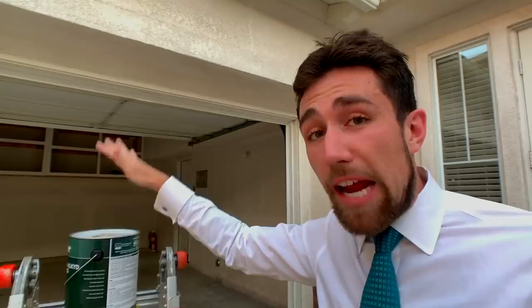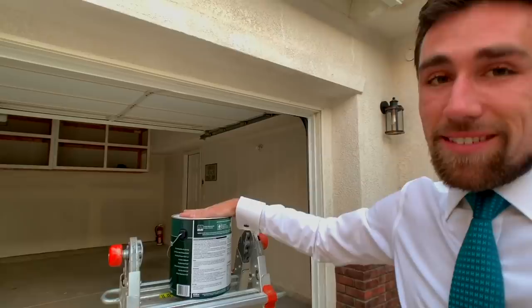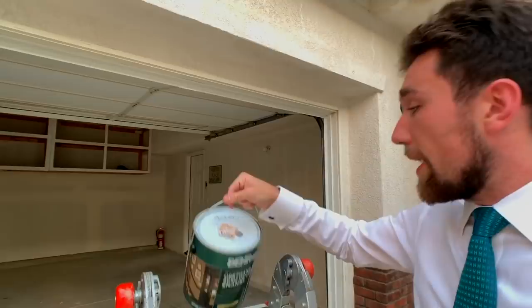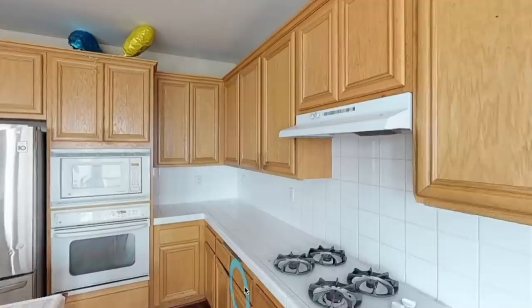Cleaning up the oil-based primer is a little more of a headache with an airless sprayer, but it's so worth the finish compared to brushing and rolling. This product actually recommends sanding first, but because we used the primer which doesn't require sanding, I thought let's give it a shot. The color is Coventry Gray — enamel semi-gloss. Get five gallons of that; honestly you might only need four, but if you get a discount getting five, why not? Let's reveal the kitchen — here's the before of these cabinets, and now I'm going to show you the after.